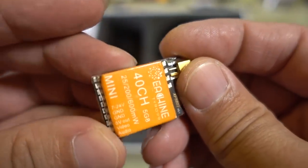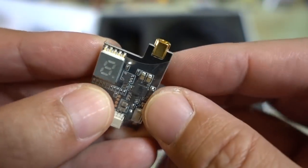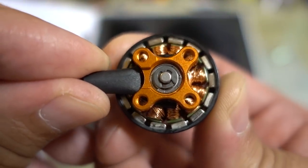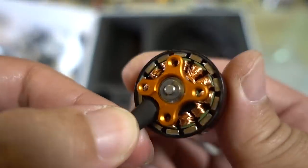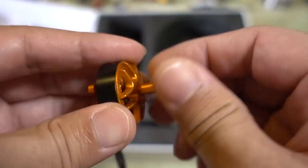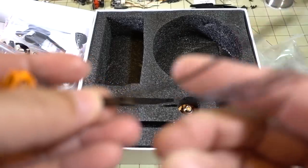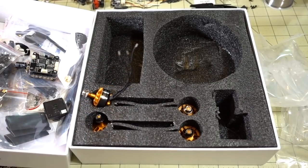Here's the video transmitter — power switchable, got an LED, a button for switching, and your MMCX connector. Pretty basic. And here's the motor — a 2206 2150KV, open bottom design, rated up to 5S, which is probably why it's lower KV. I'll be flying this on 4S though. It's not a hollow shaft, has a c-clip on the bottom. The motor wires are coated in plastic, which is a bit of a downside — they're saving cost there, but it might make soldering a bit of a challenge. That looks like everything in the box, so stay tuned for the build video coming up pretty soon.